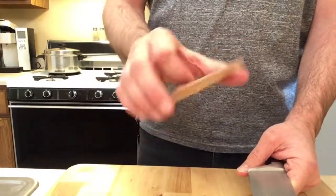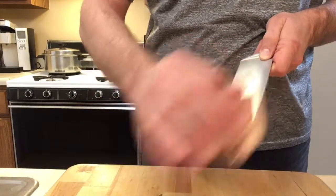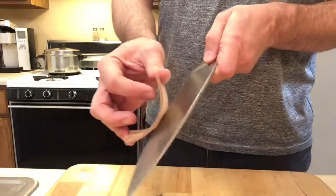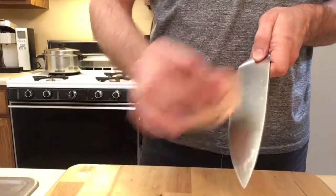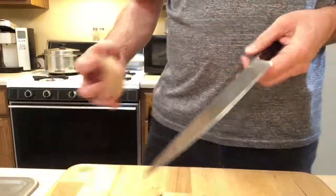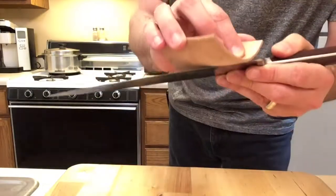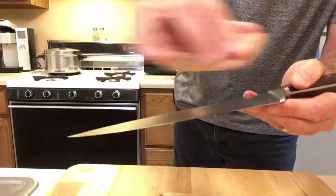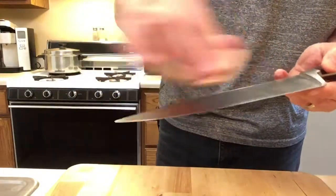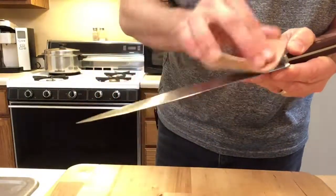So if you don't have a honing strop, get you a good piece of leather. And you want to bow this so that there's no chance of you cutting yourself, okay? You're gonna run all the burr onto one side. Flip the knife. I'm not running a steep edge on this. I'm basically almost flat with the knife, okay? This is a little technique that I came up with, but it works so well if you've got a good piece of leather.